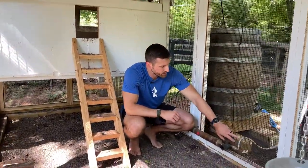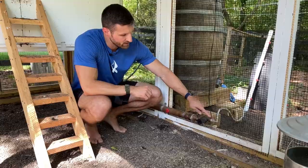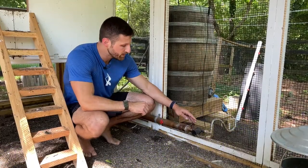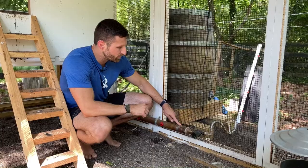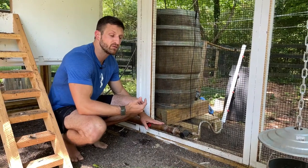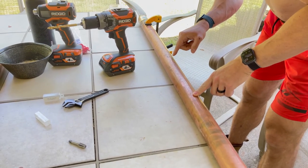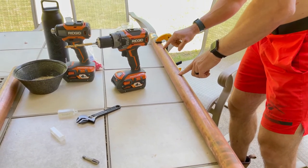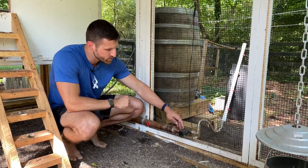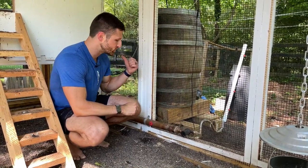Down here we cut a little opening into our mesh wire to get the hose in. The hose is connected to the recirculation pump that's plugged into an outlet up there. The recirculation pump kicks in if temperatures drop. From here we go into a copper pipe that I soldered. It basically consists of a regular two-inch pipe — I got a 10-foot pipe at a local plumbing store and cut it to size. This one is I think 48 inches long, but all the measurements, parts, and everything are listed in the description. We have some fittings, sleeves, and reducers to be able to screw in the recirculation pump on one side and the hose on the other side.